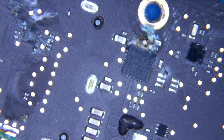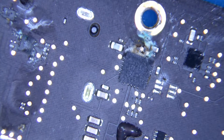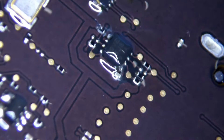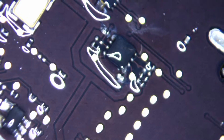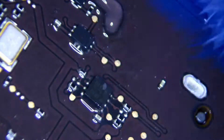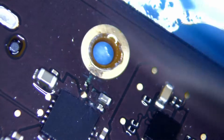Usually you would see it get a little worse, but this is probably the area that's on the worst side. We're going to go ahead and do a cleaning — put some alcohol on it. We're going to use a little brush. Most of the time we don't like using a brush too much if there's a ton of corrosion, especially deep in an area, because that can knock out a lot of the components. Sometimes you want to put flux first to mix with some solder, which can clean it well and reattach components that are a little loose — corrosion can loosen up solder. But this looks more like surface area damage.